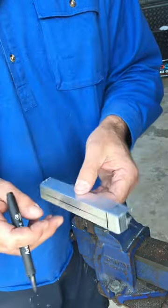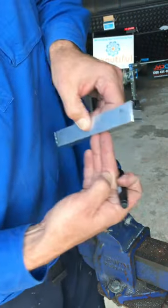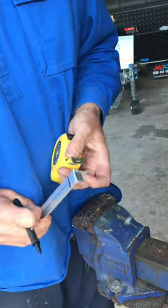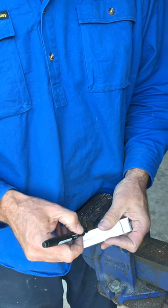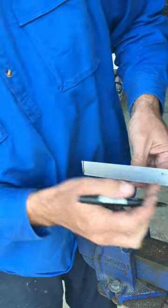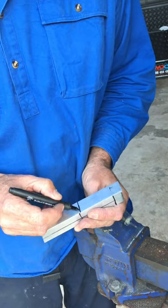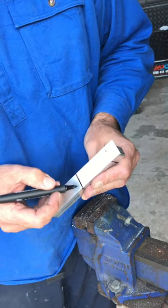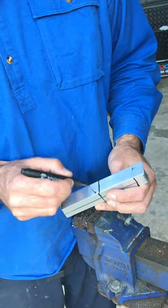Put a line down there. That's the bit that's got to fold down, and then you pop-rivet that to the front of your van. You've got to measure down this way — probably roughly 80mm, mark 80mm. Line down that way, and then again you just want to keep the same angle as that one if you can. Use a ruler if you're going to do it nicely. And so that goes like that, and then this bit is waste.